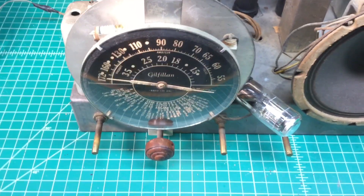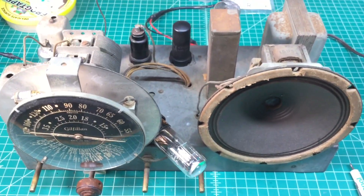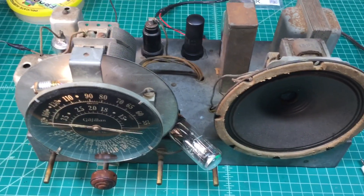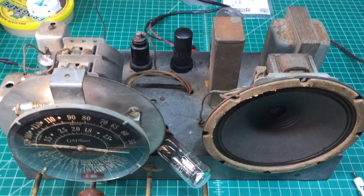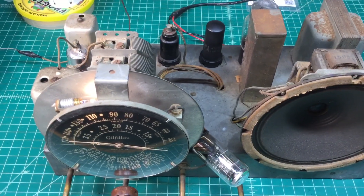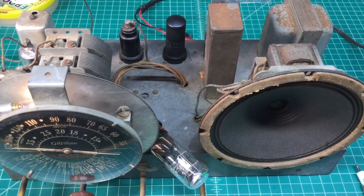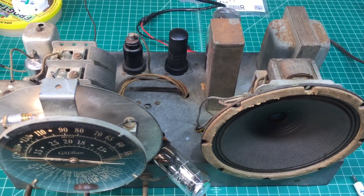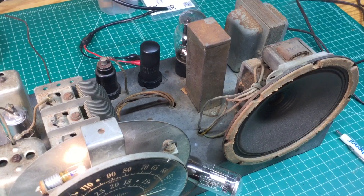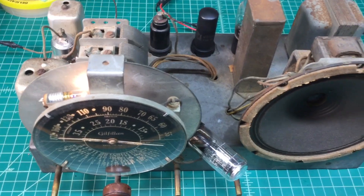Again the recap on the radio - it turned out good. The eye tube is now responding since we got the B-plus voltage up, as you can see in the video. If my dad's able to restore the wooden cabinet, I'll probably grab this back from him and finish up on the chassis itself. It needs some de-rusting, and I may actually have to pull the tuning condenser out. We'll re-mount the power transformer and clean that up as well. You can see in the center of the screen that electrolytic can I left in place, with the two new electrolytic capacitors underneath between the terminal strips.